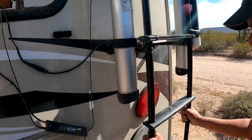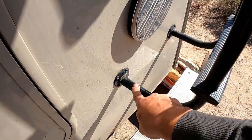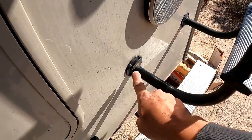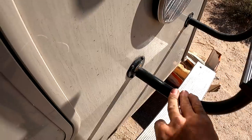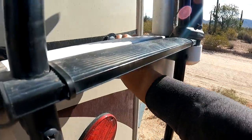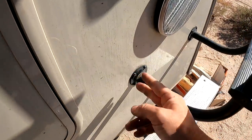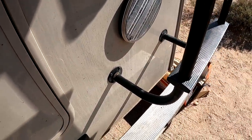What they should have done was just weld this — it should have been a welded assembly, not screwed on. That's what I don't understand and don't agree with. This flange bolts onto the ladder instead of actually being welded on and being one piece. What has happened is this bolt has worked its way loose, and it's causing the whole ladder to be loose. Some of these have loosened up as well going up — the top ones are loose; they're all loose. Instead of making this one whole piece and bolting the ladder in, they bolted this and this is screwed in. Definitely not good engineering on their part.